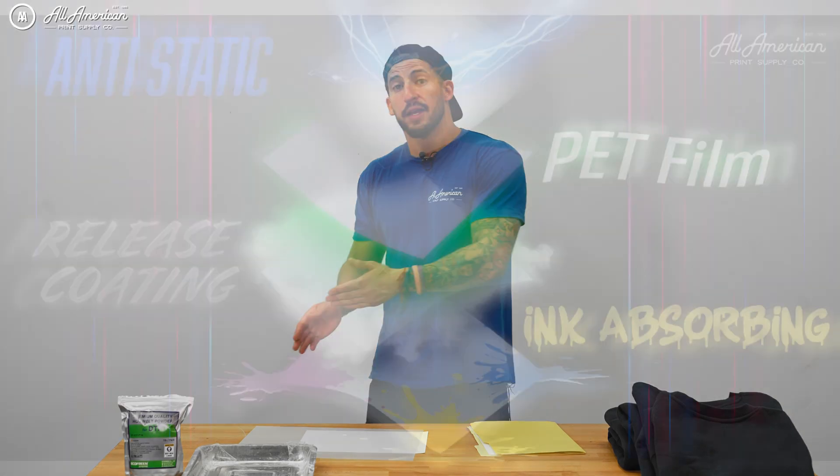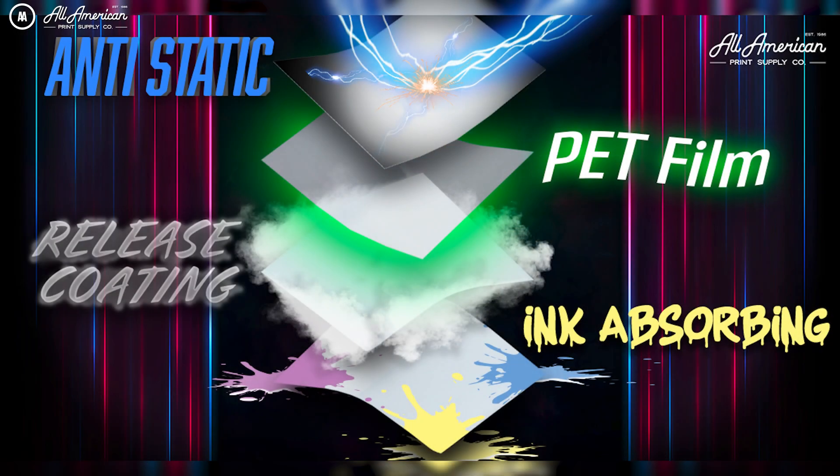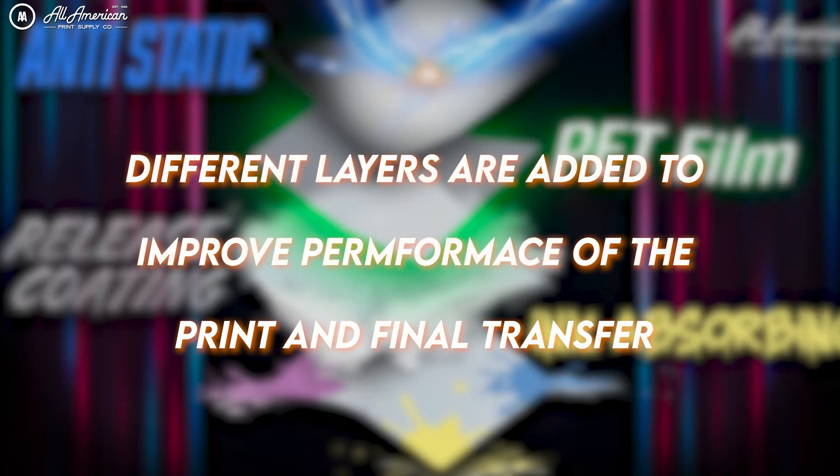Typically, we see GSMs between about 75 to 100. Anti-static layers and ink release layers can add approximately between 5 to 10 GSM. Now, as far as individual sheet printing, it doesn't really matter too much as far as the thickness. However, we have found that 75 GSM works tremendously with pinch rollers for more of a production setup. In the different films that we've tested globally, they have been very consistent, but we've found that 75 has been pretty much the standard.